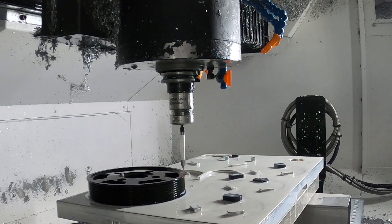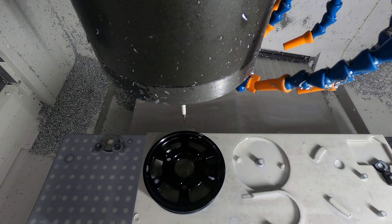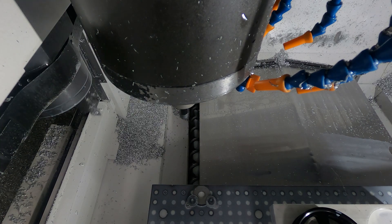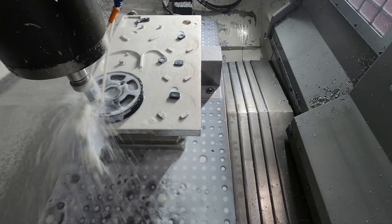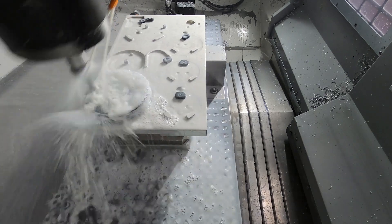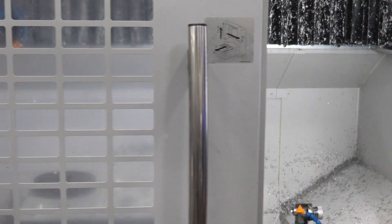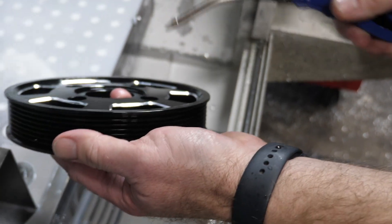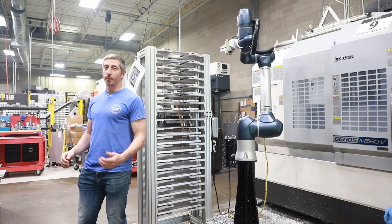If the accuracy or location of one of those parts was incorrect, the machine would stop. If it's approved as in a good location, the machine would then go ahead and complete the rest of the machining process. The black diamond process only takes off an extremely small amount of material, basically just removing the anodizing to show the polished aluminum underneath. Once the part has been completed, the machine will remove that fixture back out of the machine. The parts can be cleaned and then sent off to polishing. Let's head over to another mill and see our one-and-done start-to-finish process there.